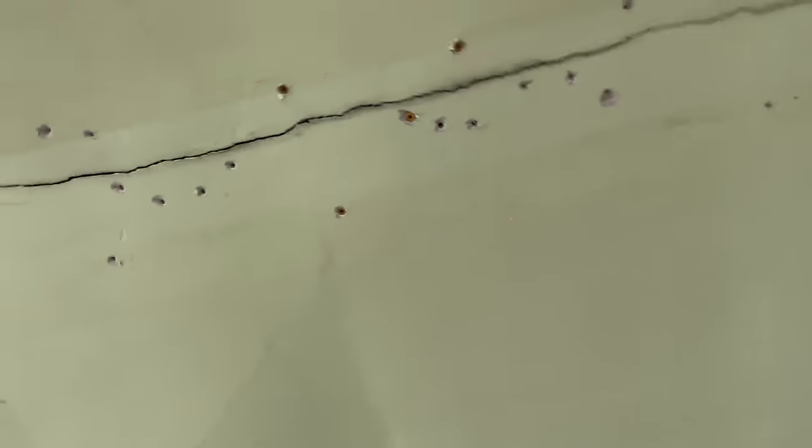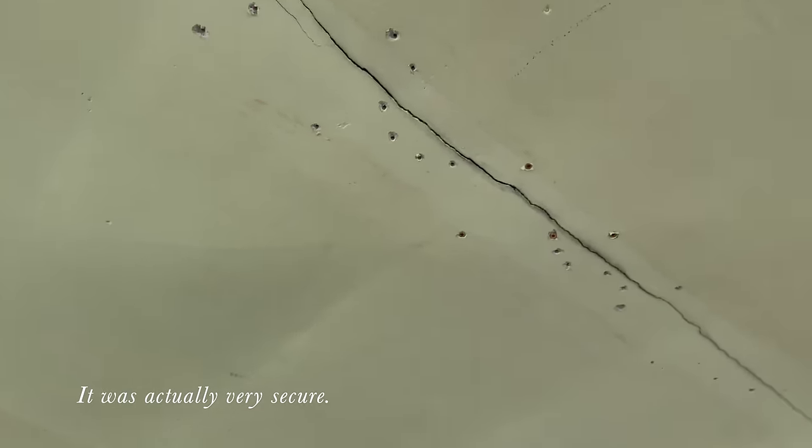Here is the aftermath of trying to anchor this plaster to the ceiling a little bit better. For some reason, we were not hitting any of the lath. I don't know why. Some spots we did, others we didn't. But it does feel like it's still pretty secure on there. So hopefully those screws that we added will just anchor it so we don't have to worry about it. But we just kind of went around where we could. So now I have all of that to fill.